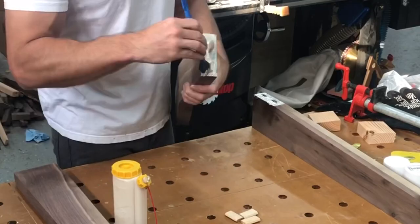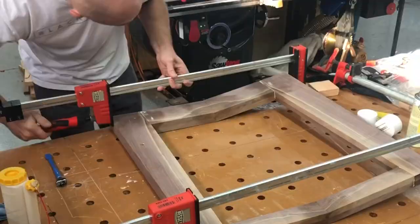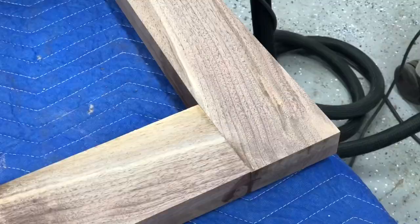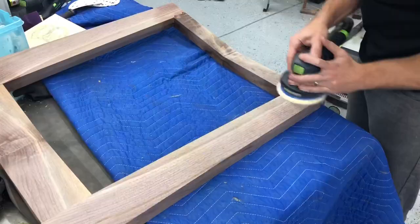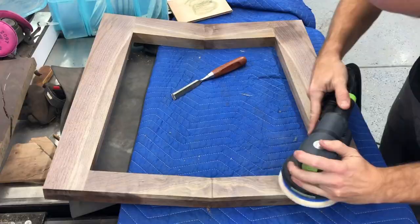If you look closely, you can see that the edges near the glue joints are a little bit darker, and that's because I added shellac. That's going to help the glue come off a lot easier after it's dried — it's a pretty good standard practice to add a little bit of shellac to those glue joints, and it'll help it sand off easier. I should also mention that I sanded these before I glued them up to 150 grit to reduce a lot of the sanding I was going to have to do when it was all together.